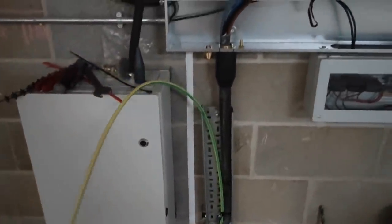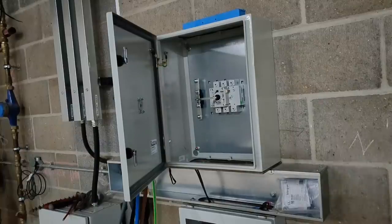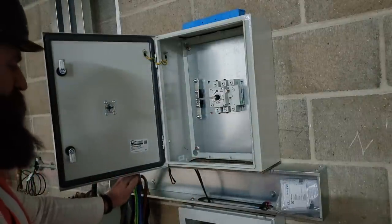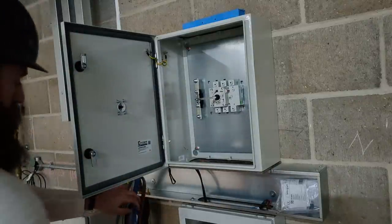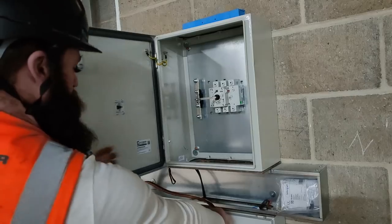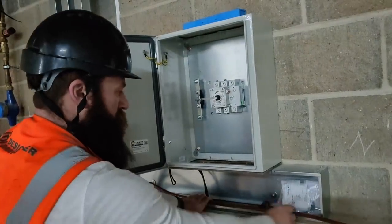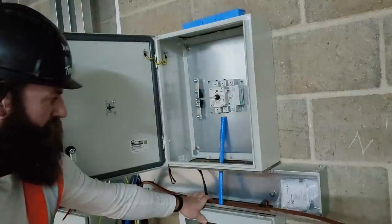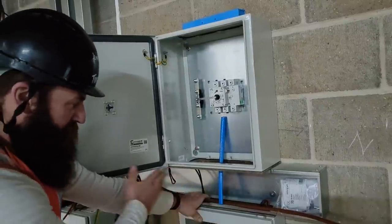Cable's in. I'm just going to put the earth up inside now. Bring the shroud and then I'm going to open that and have a look at the terminations in there. Right then. The good thing about three of these is that they're straight in, crush fit fittings. So there is no lug required. So if we see. See where I'll use that. So that's where that's going to go. That's there. That's where I want it to bend. So I'm going to put my hand, I don't know, about 70-80 mm further back from where it needs to bend.